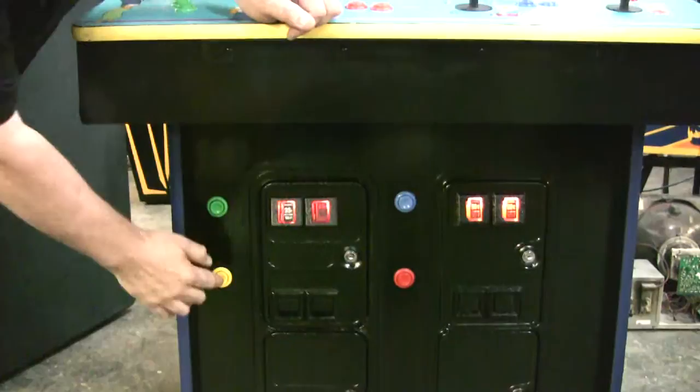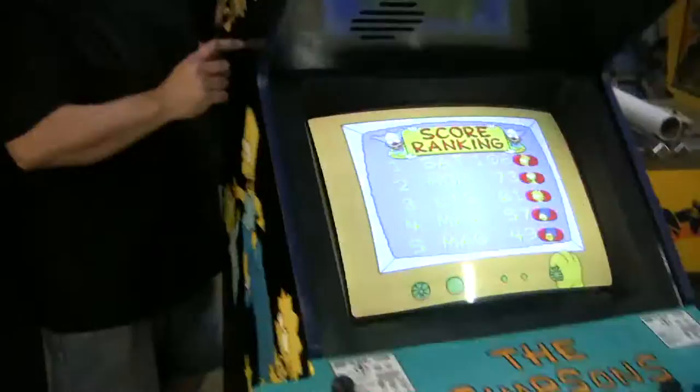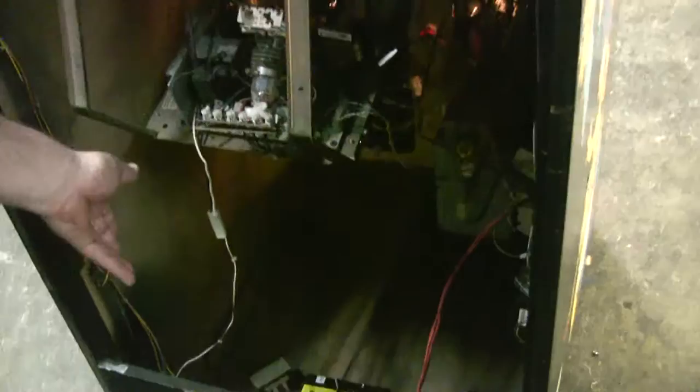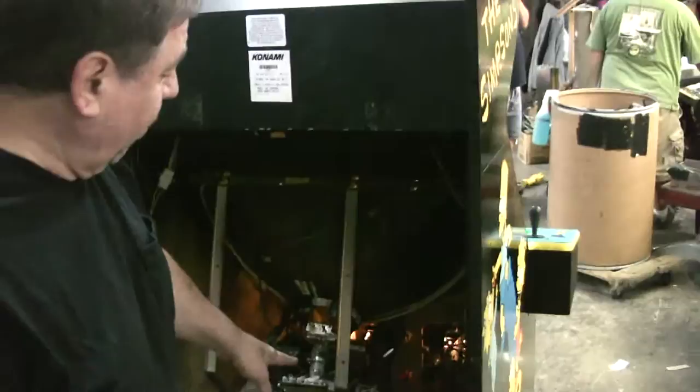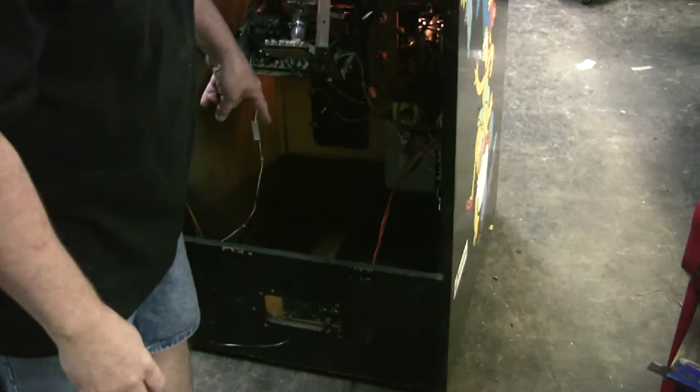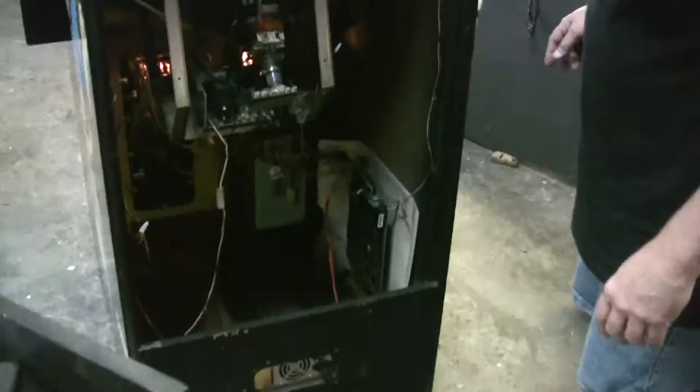Jonathan, get some detail on how nice the side art came out. A lot of guys worked on this — Wallace, Dan, Chris. When we opened it up, there were two isolation transformers for the monitor — two of them. The original one was fine, so we took out the second one. The good old 7000 25-inch chassis — the very best in the world. Fixed. Power supply was ugly, rusty fan — brand new one. We cleaned up the wiring. It was a pretty messy game when it came in, but now it looks beautiful.